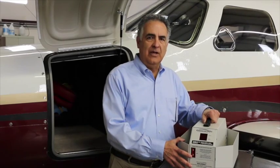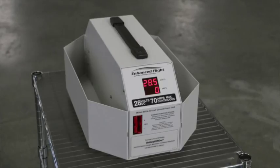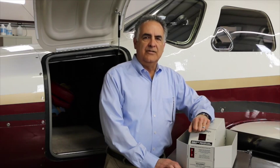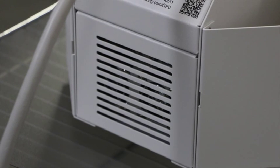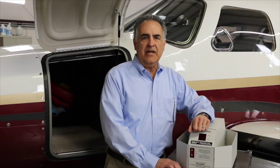The GPU is lightweight, so it's easily portable. Its case features removable cord and tool storage on each side, and large digital output indicators for both voltage and current, angled for optimal viewing. A 2-meter output cable with a standard 3-pin oval aircraft plug is also included. The GPU has internal cooling fans with the intake at the back and exhaust out the bottom of the front of the case. Take care not to block either, as ventilation is necessary for proper operation of the GPU.